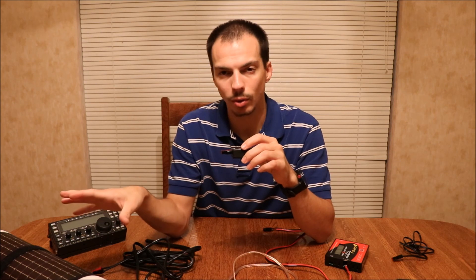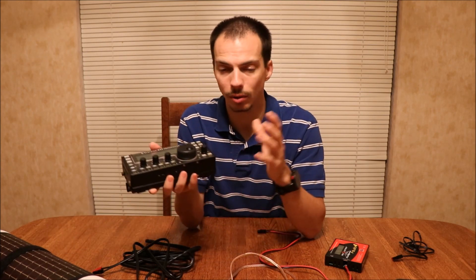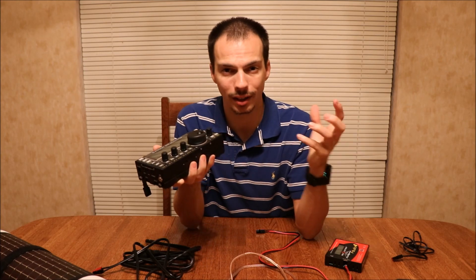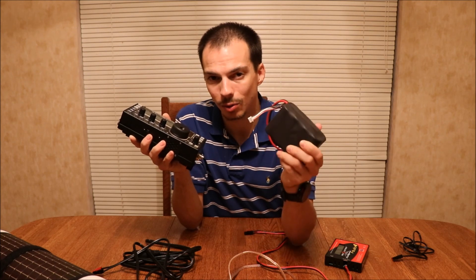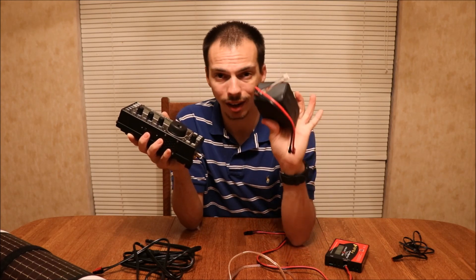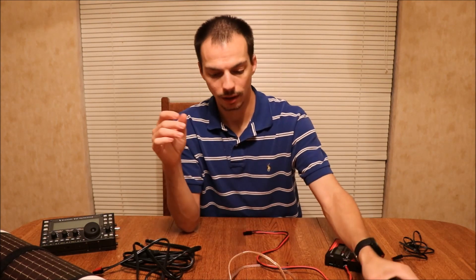There's not always a day with full broad sunlight, so your wattage from the panel may be 15 or 12 watts — that's why I chose the 21-watt panel. I didn't figure I needed anything more powerful, but I didn't want anything less. I have used the double A's and they work great, but without an extra charging source or carrying two or three spare sets of double A's — which might match the weight of this setup — this 5 amp-hour lithium battery is a better solution. It's not quite the capacity of a 7 amp-hour sealed lead acid, but it weighs a lot less, holds voltage higher, and holds a shelf charge for longer than a sealed lead acid.